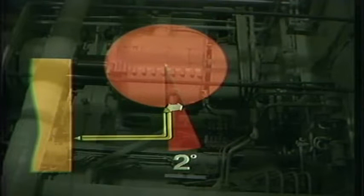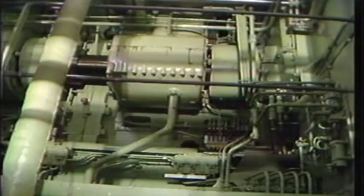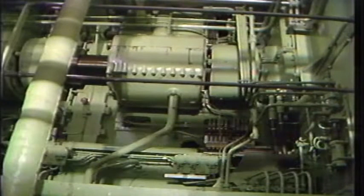The change is measured with the help of the pin gauge. On the K90 engine, 2 degrees is equal to 4.8 millimeters. Adjustment instructions can be found in Volume 2, Section 906. After camshaft adjustment, the engine's maximum and mean effective pressure should be checked.